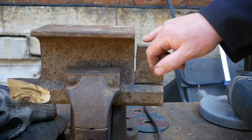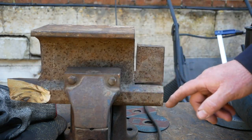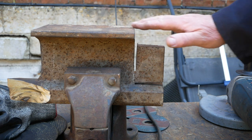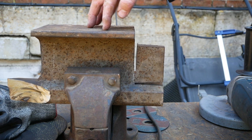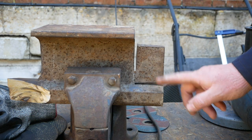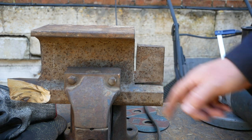This is about as far down as my grinder can go, and I had the same issue on the other side. So now I'm going to try and hammer that off with a cold chisel and hope it snaps off. I would have liked the foot or base to come out further, but it's just impossible to cut — certainly with the equipment I've got; maybe with a torch you could do it. What I'm going to do is bolt this down onto a log to keep it stable, because I understand that if I hammer on the hardy hole area it might tip. But anyway, let's try and snap that off now.